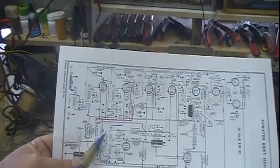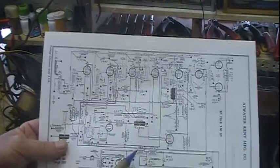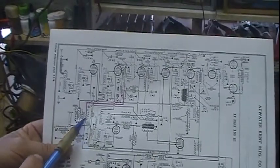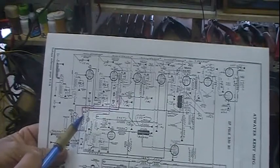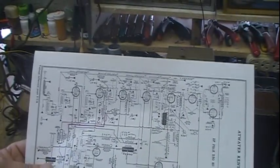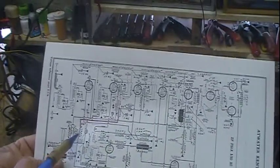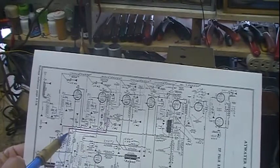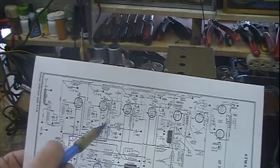If you look on the schematic here — I've got it colored in — that's the wire I missed. Power comes along this line from the power supply, feeds along, and then it goes through a dropping resistor right here. Well I had that in place, but I did not have this lead hooked up to it. Where that hooked — if you look back on the old videos — the condensers, all the capacitors, are encased in some sort of cans, generally up to four capacitors to each can. This is a wire-wound flexible resistor, and it soldered to one of those cans because there's a cap that comes off of it. But I didn't solder the other wire on, which goes to this little node here, and everything else was all attached there for the B-pluses.